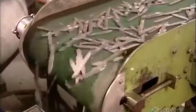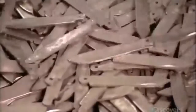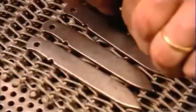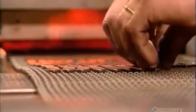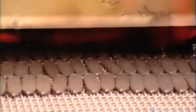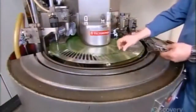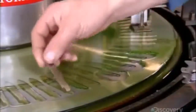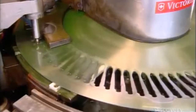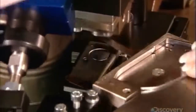The process has smoothed the blades significantly, but the metal is weak and dull. So a worker arranges the blades on a mesh conveyor, which goes into an oven that exposes them to intense heat. A quick cool-down follows, which toughens the steel considerably. The hardened blades now ride a carousel into a grinding station, which slims and trims them. That green liquid keeps them cool during this process. Afterwards, a computerized tool measures the blades — if the dimensions are even slightly off, they won't fit into the knife handle. A quick stamp gives the part its trademark name.